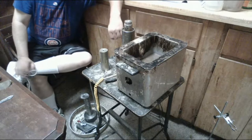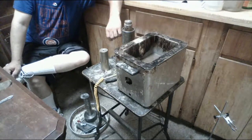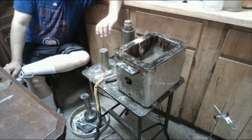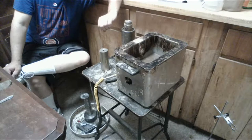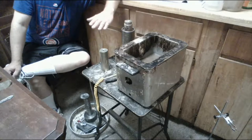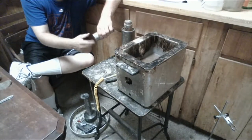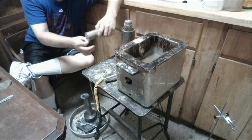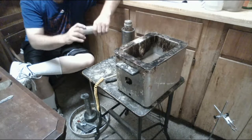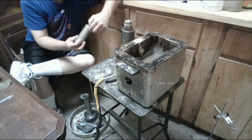I wonder how many of you are aware that if you go to the Edison Laboratory in West Orange, New Jersey, and go up to the music room, in the hallway to the music room there are two phonographs. One is from 1887. It has a kind of skeletal top, and the motor is exposed underneath, on a wooden breadboard. The mandrel has a drive on it. On this end of the mandrel there's a little bevel, and I'm not sure if it's rubber or leather. The motor turns, and then it turns the mandrel. I don't know what kind of governor it has on it. The governor is part of the motor.